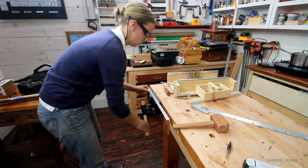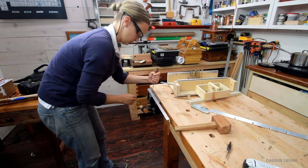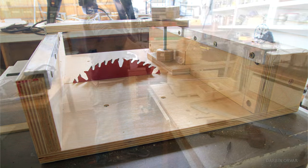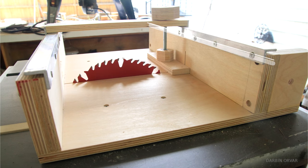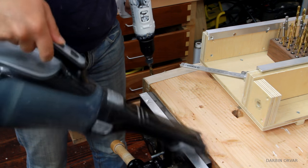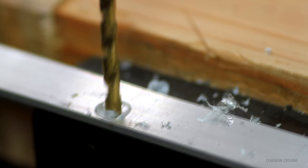Next, let's prepare the metal. Put the aluminum in a vise and mark out six holes across the piece with an awl. The metal will be screwed into the fence and will be situated rather high up, so make sure your holes are on the lower side of the metal. Once the holes are marked, pre-sink the holes with a large bit — make sure to not go all the way down. Then drill all the way through with an appropriate bit for your 1 inch screws.